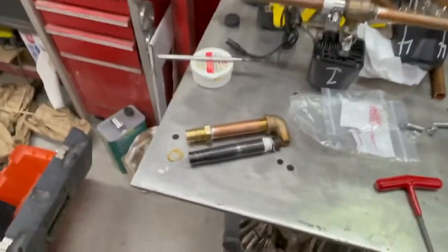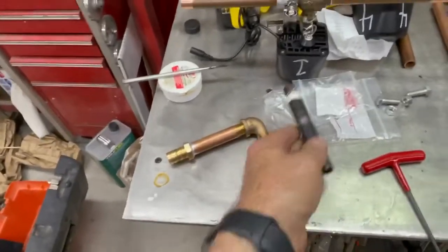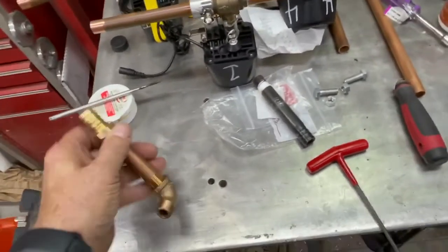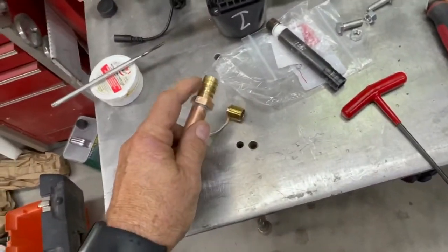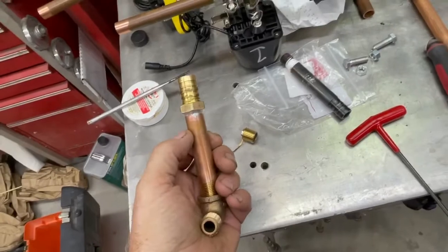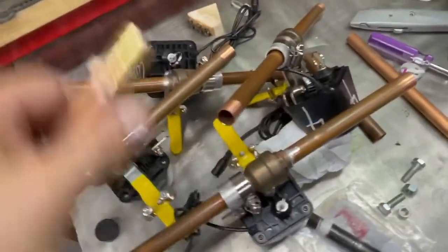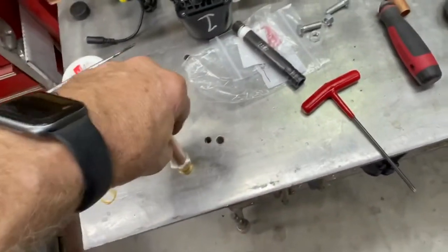And I got down to this. The other pump came with this piece of blued steel pipe. It was already rusting. So we're switching it to this. This is the fun part. I cut that off of this fitting right here. Well, actually, those came off of this guy. But there was a fitting on the other one I cut off too. And then I just machined a little recess, set it in there.